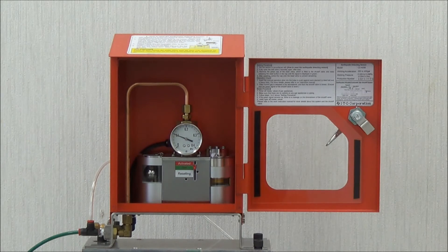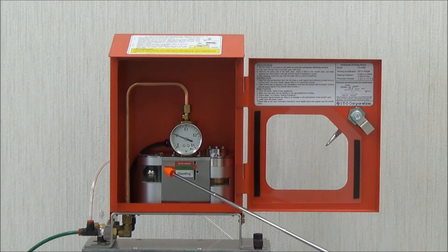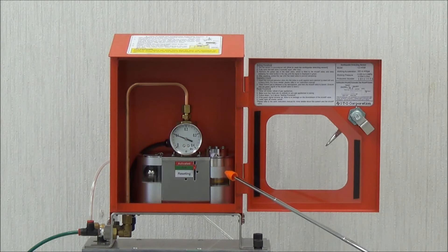Within the sensor unit, there is a reset lever, a steel ball and a magnetic bob. These elements are put in place with the reset lever. For the cut-off to occur, both of these two elements must drop. This ensures that there are no false shut-offs from general vibrations, such as dropping of gas cylinders nearby. Both elements will drop at separate frequencies for horizontal and vertical movements.